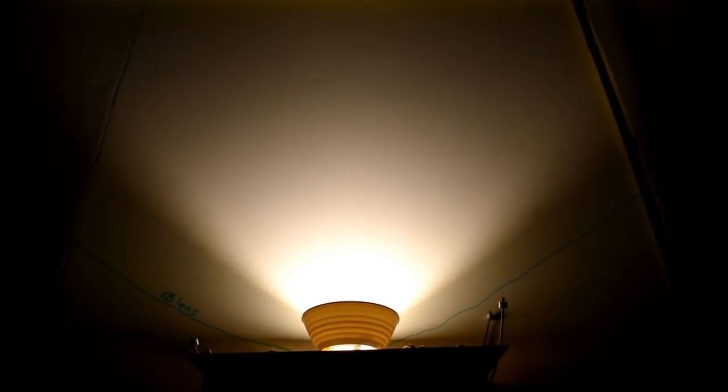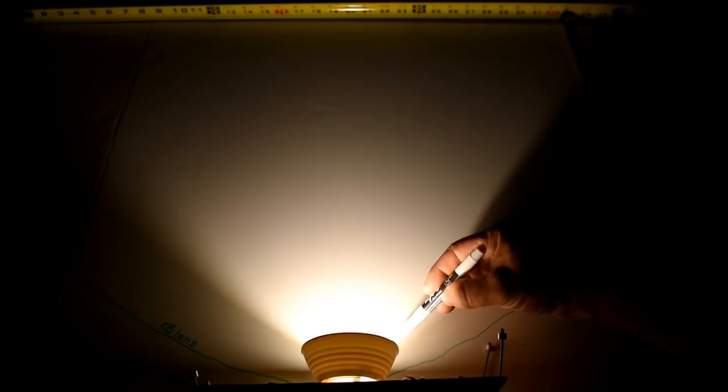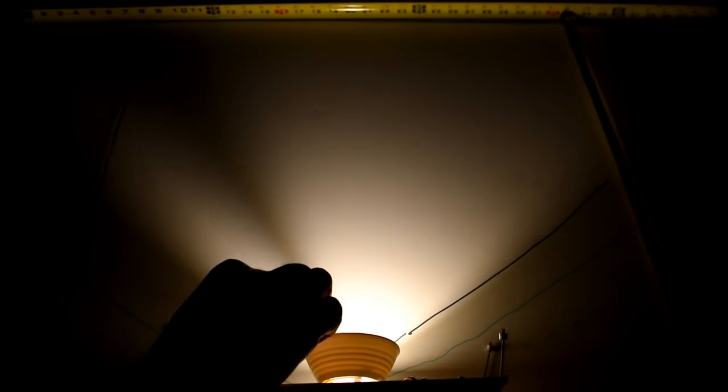Now let's take a look at the little Angelina 90-degree reflector. It's a pretty inexpensive plastic reflector, so you're going to save a lot on weight. You'll need to use an adapter if you're using the Ideal COB holders, but if you want an all-in-one solution, check out the BJB COB holders on Pacific Light Concepts — this reflector will fit right on that holder, reducing the need to drill extra holes. It actually emits a beam angle slightly less than the 80-degree King Bright lens, even though it's rated 90 degrees.